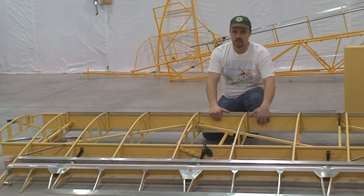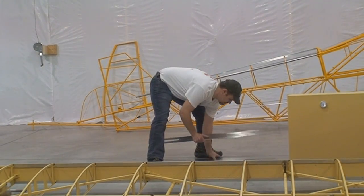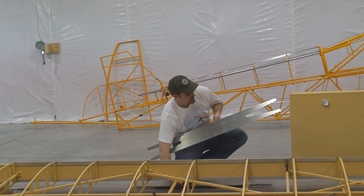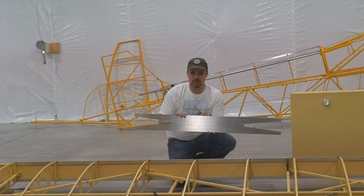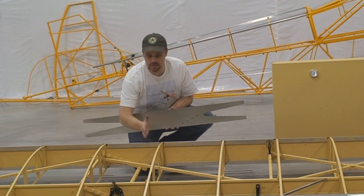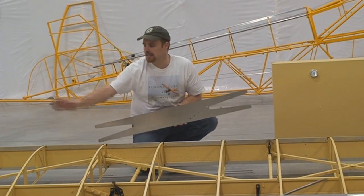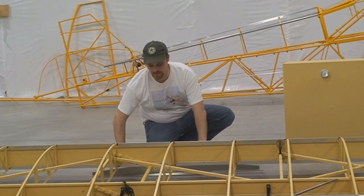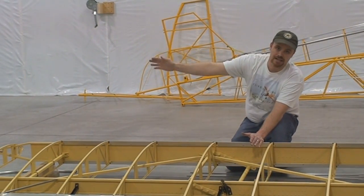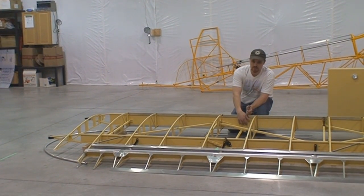This particular wing has an option of a spar doubler. They're installed. So these plates right here, this is 1/8 inch thick 6061 aluminum as well, and they are centered right on the strut attachment point. This is the weak pivot point. When you get a high lift load on the tip of the wing, if that wing gets a high load on it, this is where it wants to buckle, right down the center line of that strut attachment point.